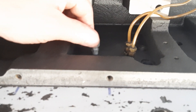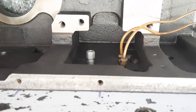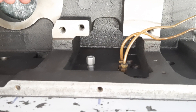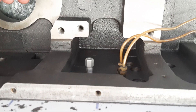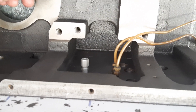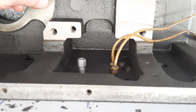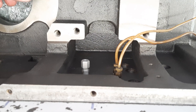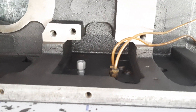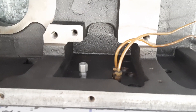What I've done is I've had to modify the lube system. Obviously I've changed over from the NSK, which I've talked about in the previous video, to the Hiwin linears. And obviously when you change something there's a bit of stuffing around - it's not just a matter of changing a couple of bolts, it's usually fairly major surgery. Normally the lube systems - the blocks themselves, the linear trucks or blocks as I call them - are individually lubed, but as long as we've got the lube system lubing each linear block that's the main thing.